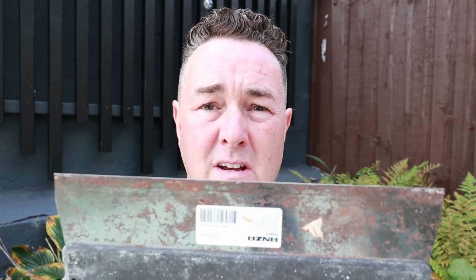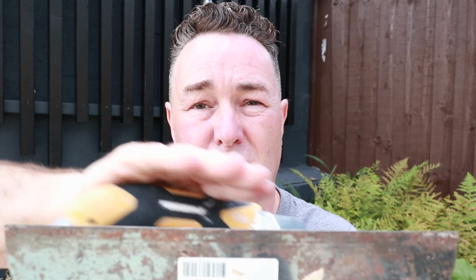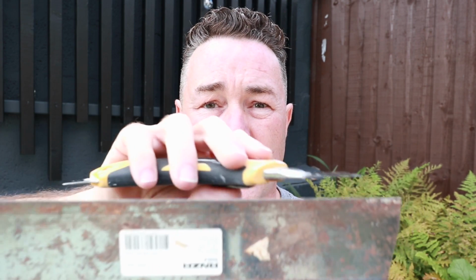If you put that up under your coving and it's rocking, you're not going to do one cut across that blade, are you? Of course you're not, because you'll be at the wrong position for where the cut is. You need that blade to be following the line of the coving, even if it just does go up or down. Use this as the guide. Make sense? Yeah, hopefully.